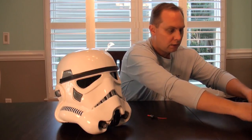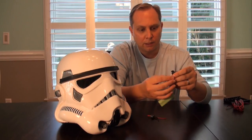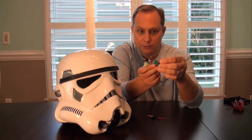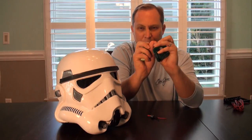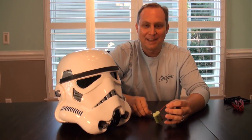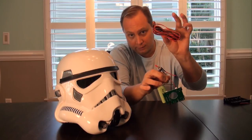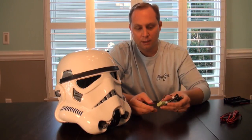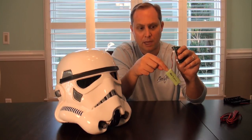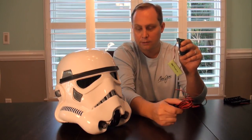Rather than a 12-volt fan, what do you do in the case of an Acre? Same concept — you've got your piece of electronics and it plugs directly into the power source. Rather than using the switch directly on the Acre — which is a little dial — you're going to want to put the switch on the power source. So you just cut the red wire and in between put your switch. You'll probably want additional lead length since you're mounting the electronics on top and the switch on the bottom. You just cut the positive lead between the piece of electronics and the battery, then splice in your switch using any additional leads you need to get it to the right length.